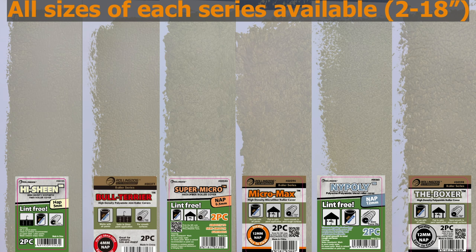Here is a side-by-side comparison of the roller coverage. It's easy to see the two shorter nap rollers on the left have a smooth looking application, which will increase the sheen of gloss paints. You can also see that the microfiber covers apply with lighter coverage. The tiny hairs of microfiber help the cover hold more paint than others, but release it more slowly. So if you usually apply two coats, using a microfiber you may want three. But the durability and lint-free application is hard to match.